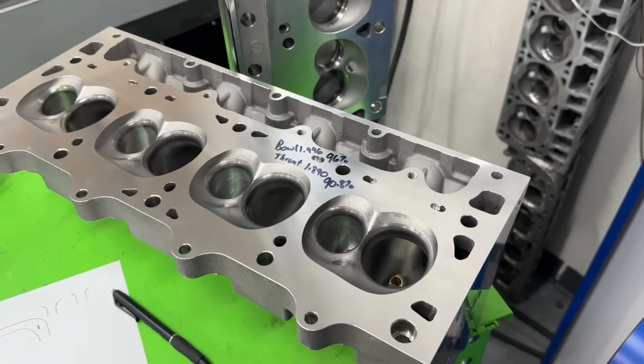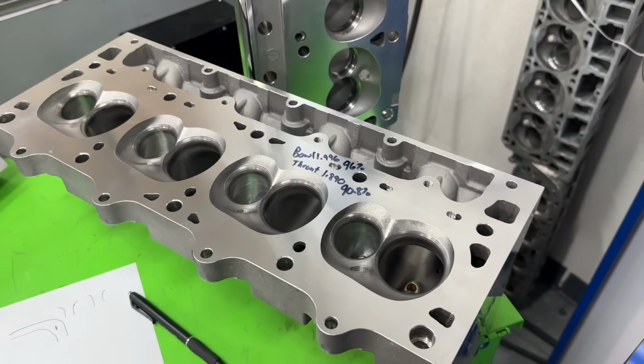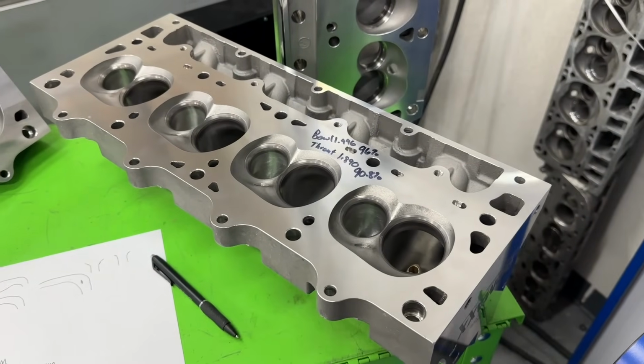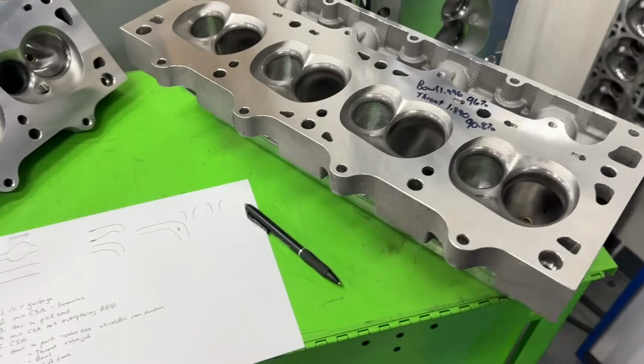Right now it's opinions. Once the dyno mule's done, we'll have an answer. We'll see if it actually peaks at the same point, which I don't think it will. I'm betting that LS with that camshaft is going to peak about 7,300 RPM, where right now the small block's peaking at 68. Okay, going on.